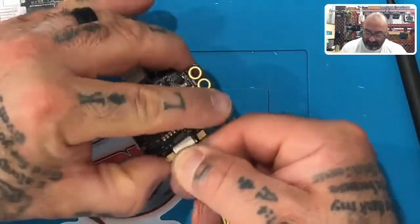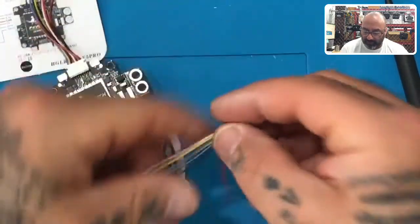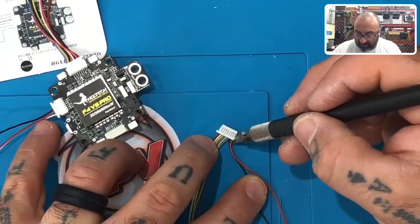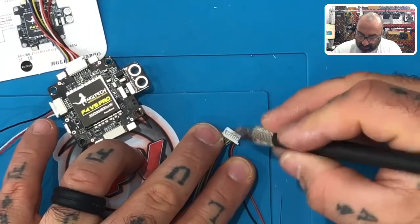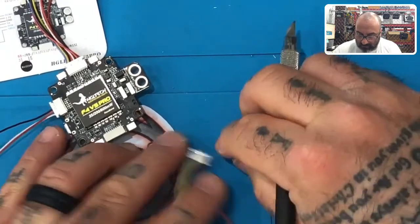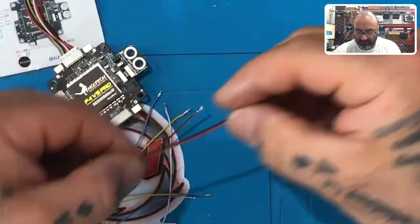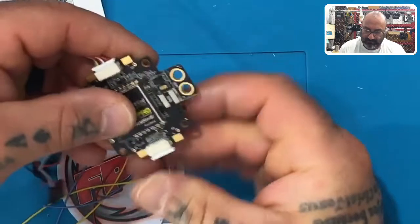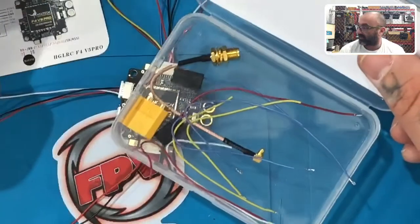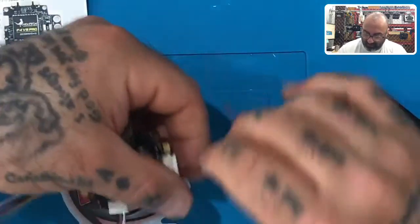Take out the bottom plug - this is the one with two blue, yellow, blue, yellow in the middle, so you know you're on the right plug. Turn it over, lay it on the table, and remove every single wire except the black and red that are next to each other. Start all the way to the left and pull up all the tabs. Pull the wires out, put the tabs back, then plug this in. Those removed wires go in your box. This is your buzzer wire - just twist these up a little to keep them from flopping around.